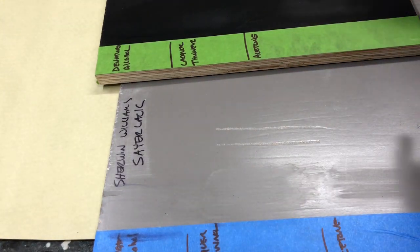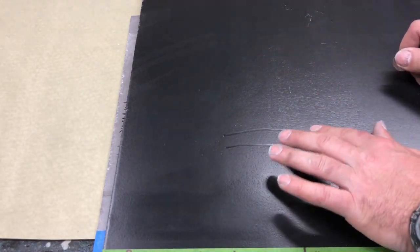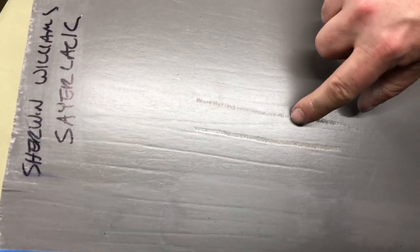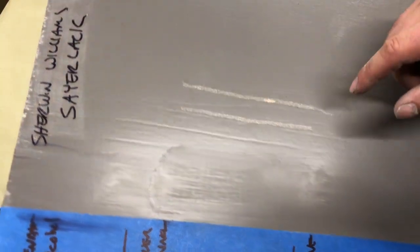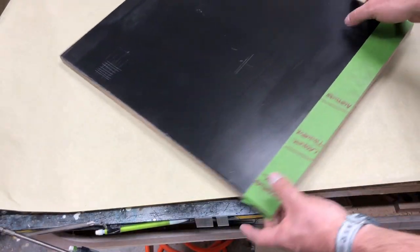Without the Crosslinker, the mar resistance is not that good. With it again — I'm not even able to affect the surface. So that's a good sign. The mar resistance without — you can see it kind of went into that surface. Now this is over shellac, and shellac is brittle, so that might be playing part of a role in that. But you can definitely see the difference with the Crosslinker. The mar resistance with the Crosslinker is excellent.